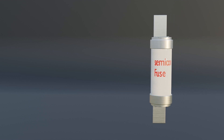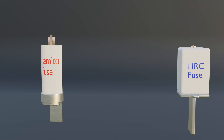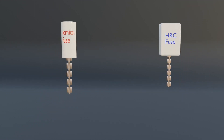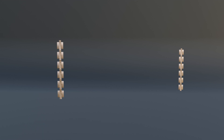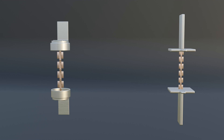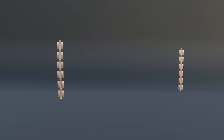Now let's talk about the difference between the semiconductor fuse and the HRC fuse. The construction for both fuses remains the same — first, there are the elements. The left side is for the semiconductor fuse and the right side is for the HRC fuse. Both sides of the element contacts are diagonally welded, and after that a ceramic cover is placed with silica powder or quartz powder inside, as you can see here. So as far as construction, both fuses remain the same, but the material used to make the element is different for both fuses.